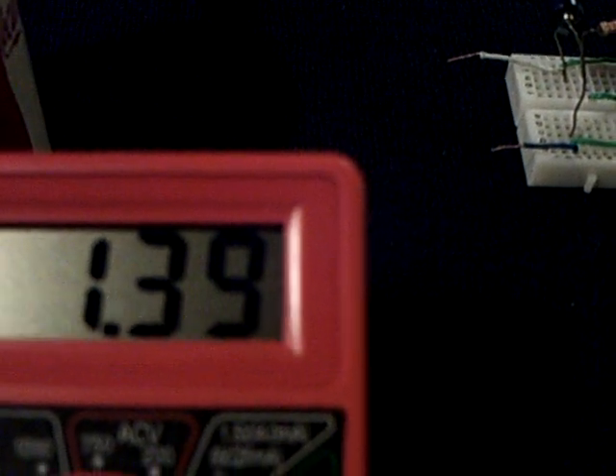I'm going to unplug it — this is going to drop down immediately. But it won't drop down to where it was before. It drops down to a certain point and just kind of sits there. Now I'm going to hook this up to the other battery, and it's going to run an LED straight up with the two batteries. There's an LED on with the two cement batteries in series, and there's the standing voltage on that first battery. It's draining down, but very slowly — more like a capacitor or a rechargeable battery. I haven't quite figured out what it was about that particular one, except that the beach sand had some iron in it — I put a magnet on it and could pick up black iron filings. That particular battery is somewhat rechargeable, and I thought that was very interesting.